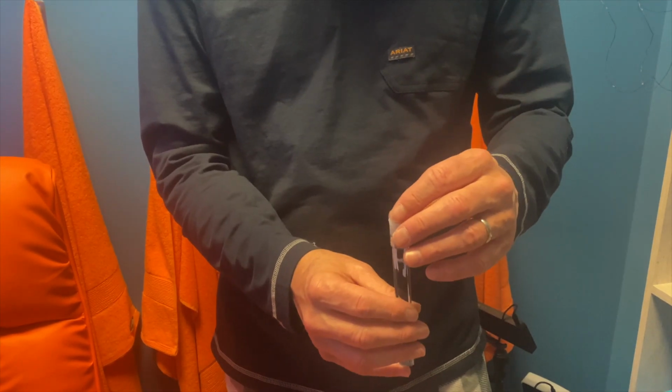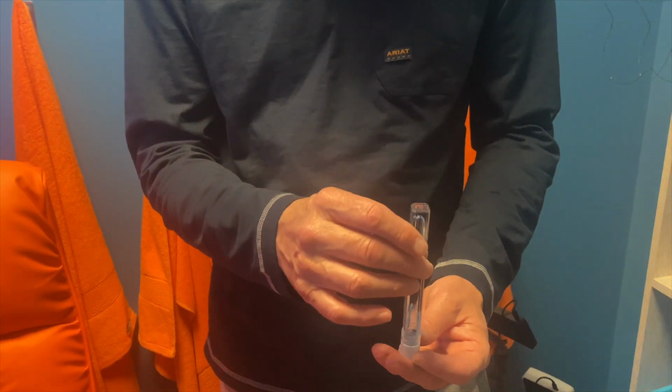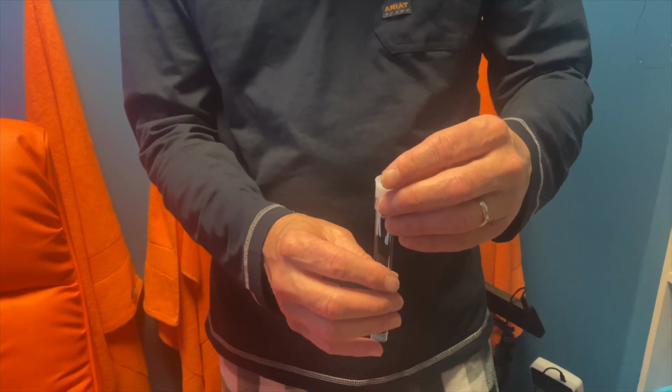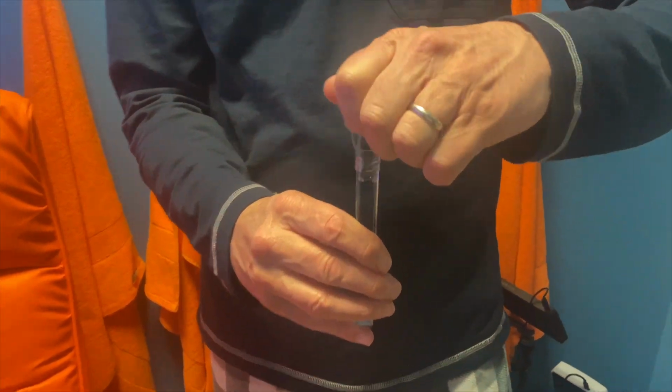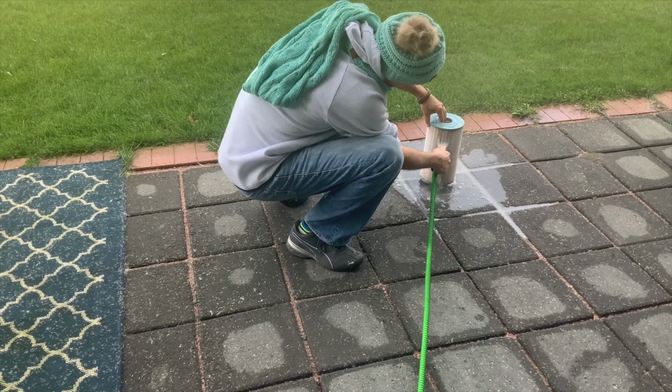Now, if you are putting phosphate remover in your hot tub, it is important that you clean your filters, because what is happening is that phosphate remover is making those particles a little bit bigger, and the filters are catching them. So make sure when you add phosphate remover that you are staying on your maintenance of cleaning your filter. That's a really big deal as well.